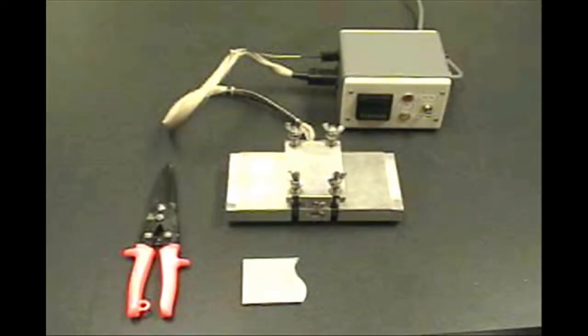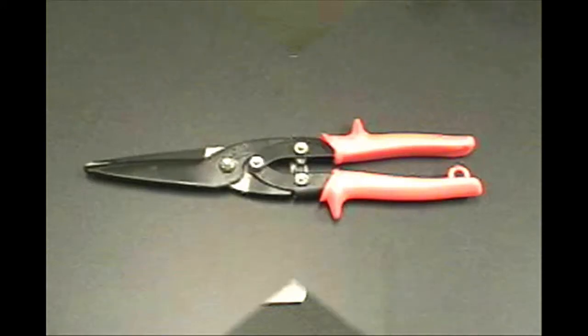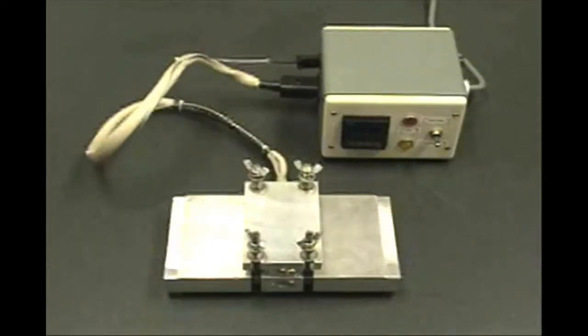Properly using the provided tools and instructions will yield a weld that is 100% of the band's tensile strength. It is important to note that a clean environment contributes toward ensuring a proper weld. Make sure the area is well ventilated and free of dirt, dust, and draft. Conduct a sample weld in the area where the installation will occur to ensure a proper weld.